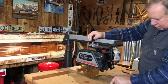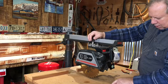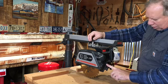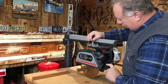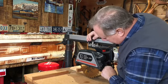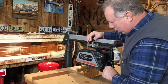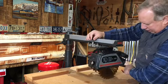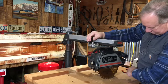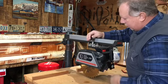It is missing the safety device here that keeps the board from ejecting, so that needs to be replaced — without question. These saws can be potentially dangerous, so I'm not going to do much with it except for straight cuts and angle cuts probably. I don't think I'll be doing much ripping like this. It can be done — they were designed for that — but you have to be very, very careful and a little more skillful than I probably am at this moment.